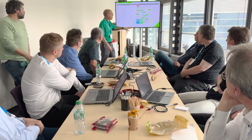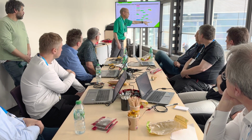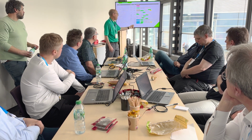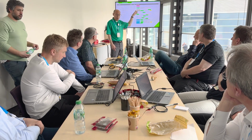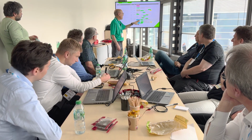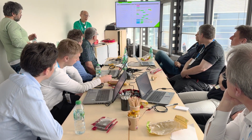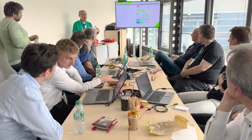You're not limited to the UART. You have SPI also available. And you have I2C, which is what we were using today to grab that temperature humidity data. And all the digital pins, so you have a whole set of digital I/O. You also have PWM output, so analog or pseudo-analog output. And you have ADCs, analog input. So you can work with I2C sensors. It's very quick, but you can work with pretty much anything on a device. And the programmability really helps you with that.